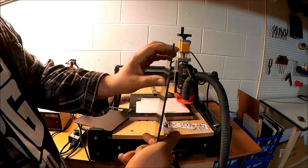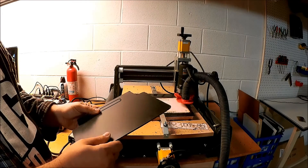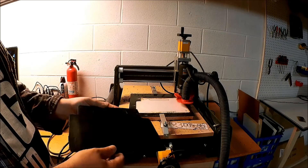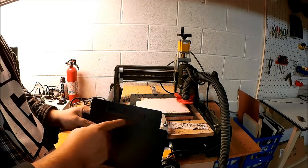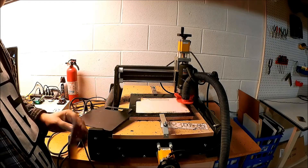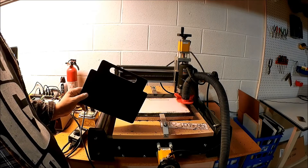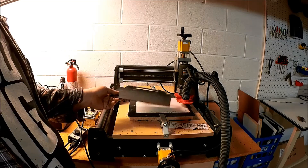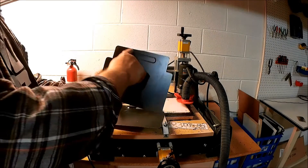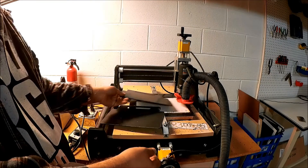You probably can't see it in the video, but it really grabbed the material and shook it — it just did not work well. There were also some leveling issues with that board; I haven't used it in a while, and the MDF over the summer absorbed some moisture and tilted, because it just came short of cutting this piece out. So I tossed that and got it out of the way because I'm really fascinated with getting this to work. I went and pinned it down with some melamine directly to the board itself. I think this MDF is not the best stuff — even on the other board I had the router put a 1-1/8-inch bed and milled it all level, so technically it should have been level. But you can see where it's off because it shook the board so bad it moved it, even though it was held in place with both clamps and the holding material. So that's spare parts.